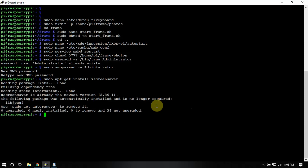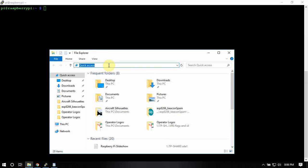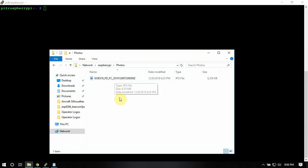Because I'm running the full version of the Raspberry Pi image, what you're going to have to do is go under your menu on the desktop, go to Menu, then Preferences, then click on the Screen Saver tab. Once that comes up, click on the drop-down box and disable the screen saver because you don't want that coming on. Once that's done, pull up a file manager window and type in the following address — that will connect you to the Pi.